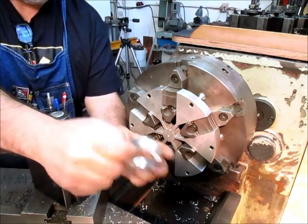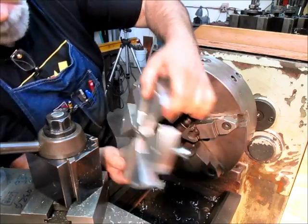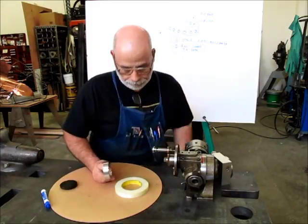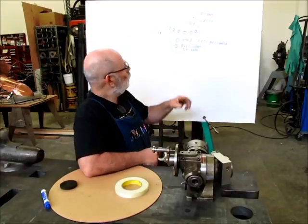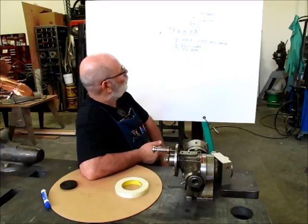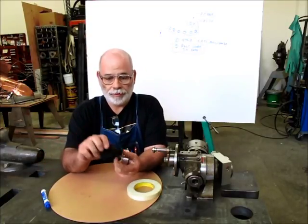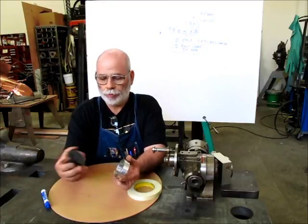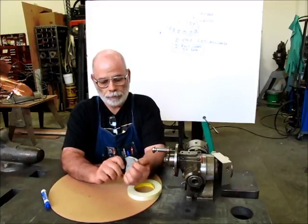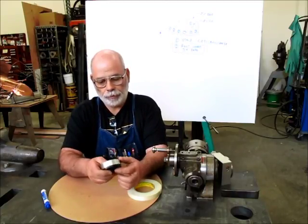So one ring, so we're kind of ready to go now. Put that away. Okay. So we're back. So we've got our ring here, and we're gonna do these peripheral holes here, and we're gonna use two methods. Just a reminder, we're gonna use a strip method, and we're gonna use this rectangular coordinate jig bore method. So while I had the video off, I made this little disc here. It's got a little step in it. This is gonna be a little kind of a fixturing piece. It fits the bore of this piece here, nice and snug. This is going to be a fixturing piece to help us index that. So we'll see that in a little bit.